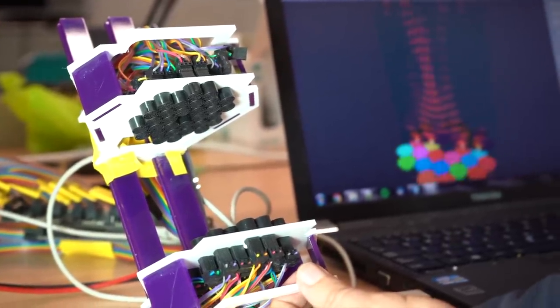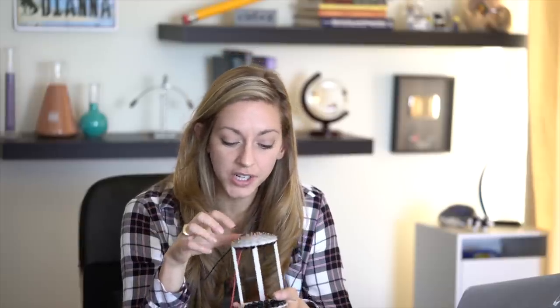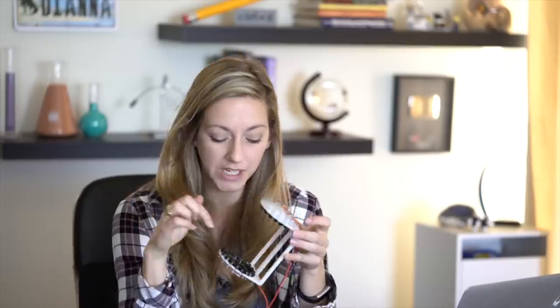If you want to do this at home, I've got just some tips and tricks that we figured out. Dr. Marzo's team put up a really easy-to-follow Instructables project online — I will link to that in the description. And when you get to the step where he says check the polarity of these transducers — the plus and minus — heed that warning. They're marked plus and minus, but we tested them all and they were completely random. Don't trust the manufacturer. Also, make sure all of your soldering connections are good. We were not able to get water to levitate with this one yet — we need an oscilloscope to test that all the transducers are working, and we didn't have one in time to make this video. But that just means our 3D wave profile in here is not ideal. If you're filming this thing, your microphone may not be happy. These transducers are putting out 40,000 hertz, which is above human hearing — it's about twice the frequency of the top of human hearing, but some microphones pick it up. So be aware of that. Happy levitating and thanks for watching. Happy physicsing!